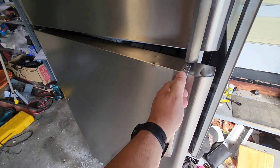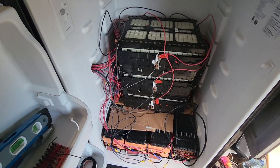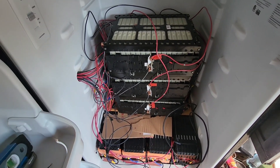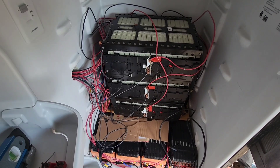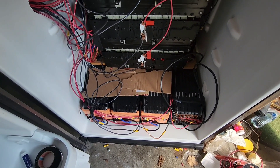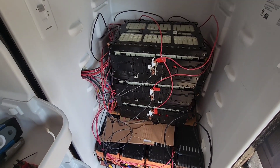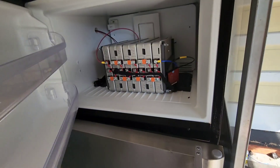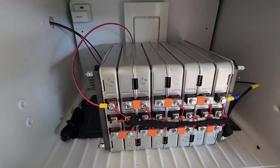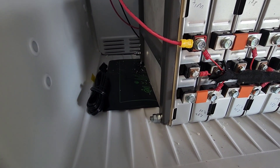What's inside the fridge? There's my tool shelf and this is the battery. These modules up top are Smart for two — I have them split in half at 16s, so there are two 16s for a total of 32. Then I have four Volvo modules down there. I'm going to put another five Volvo modules in here as well that I have downstairs. And in the freezer I have the Nissan Leaf battery that I built last year — finally got it up and running and it's doing well.